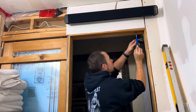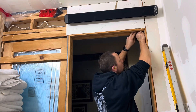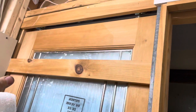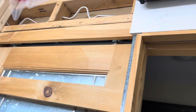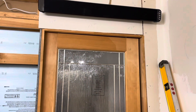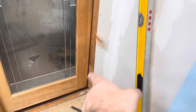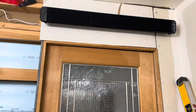If I want to have the self-closing again, I just undo the screws and put the spacers back in so that the track at this point is slanted downward. It is incredibly easy to make your pocket door self-closing, and matched with the soft-closing mechanism — amazing. I'm not going to keep it that way, but it's amazing. So now we have the spacer installed and the door is in its closed position — still soft-closing. If we bring it out, the door itself is going to want to close. It closes soft, and it's self-closing after a certain point. You'll see there's a gap at the bottom — I did just re-affix the trim, making sure it's plumb, straight, and square. All you would have to do is tighten this one up to get rid of that gap and it's still self-closing beyond a certain point. That way you don't have to monitor it as you walk away when you enter the bathroom.